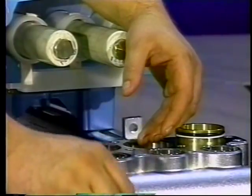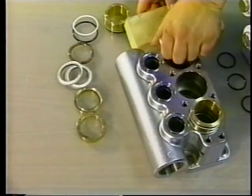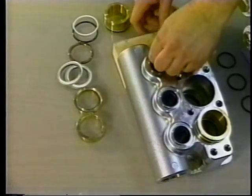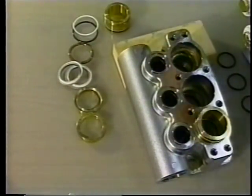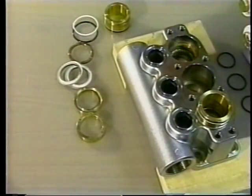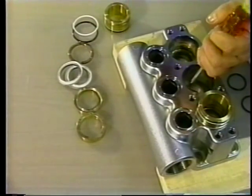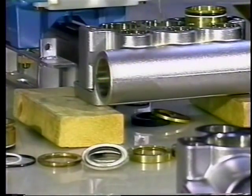Using the reverse pliers may damage the V-packings. To service the low-pressure seal, place the inlet manifold on blocks, keeping the crankcase side down. The low pressure seal and washer are housed in the inlet manifold chamber. Using a screwdriver, tap on alternating sides of the washer to drive out the washer and low pressure seal.